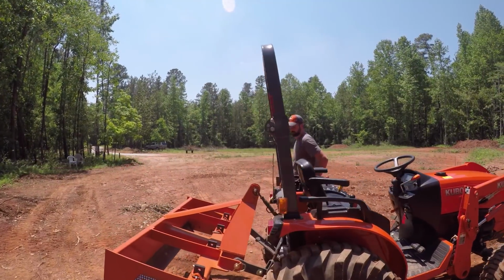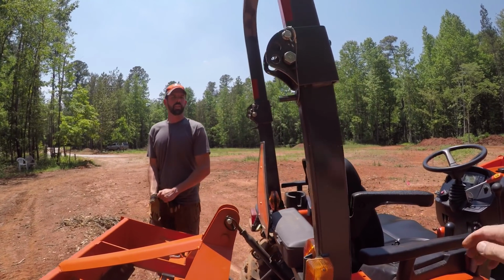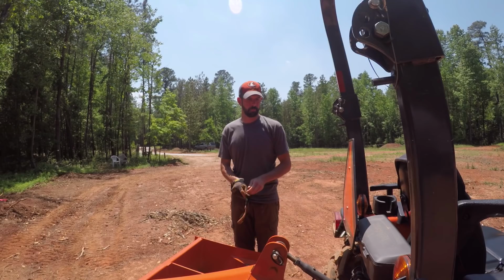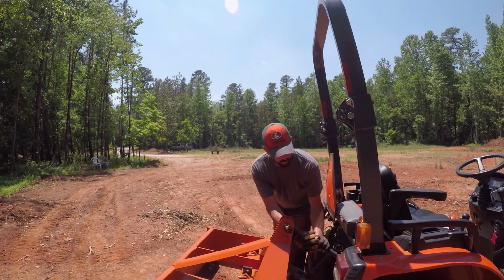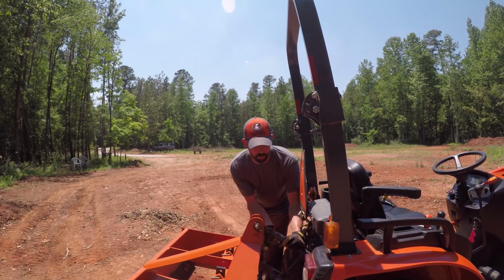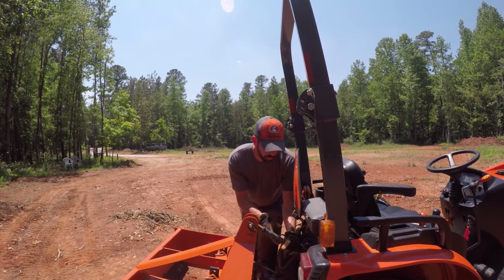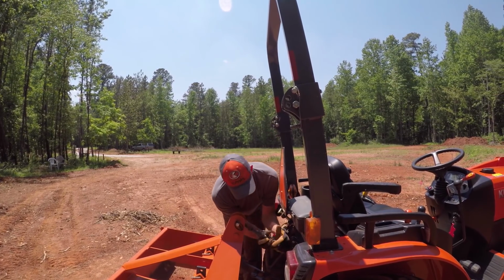Okay guys, it's not digging quite as much as we'd want. You want that box down a little bit? Yeah, drop it just a little. We're going to make it a little more aggressive. We're going to shorten that rod. You're lengthening it. There you go. And move that a half inch and it'll raise it an inch. We'll see what happens.